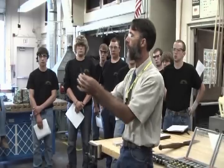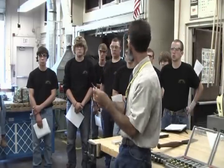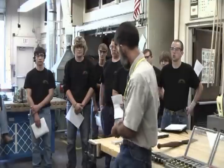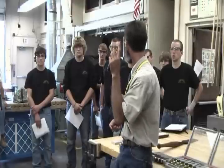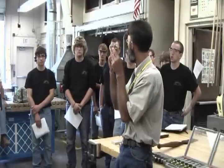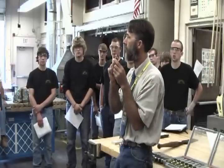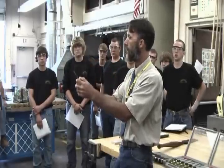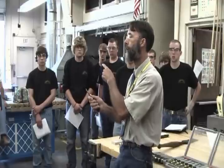Now I can turn it blue and then come back with a little bit of sandpaper, take that blue off, they'll never know. But everybody else using this chisel is like, can't hold an edge on this thing to save my life because the tempering is already gone. In that case, you have to grind it down very carefully beyond that area that you took the temper out of, and then you're back to an area that you can use. All right? So, we hold it the right way, we can grind it, we gotta watch the heat.